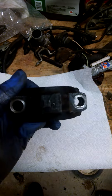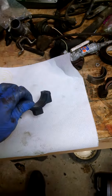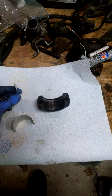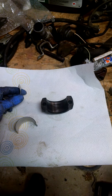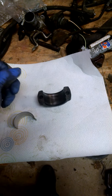I marked ahead of time — you can see the one little indentation there. This is the number one bearing cap, making sure to keep everything in the same place it came out. The reason this tractor came in is it was knocking, and it ends up that cylinder one and cylinder three had bad connecting rod bearings, causing extra play in there.